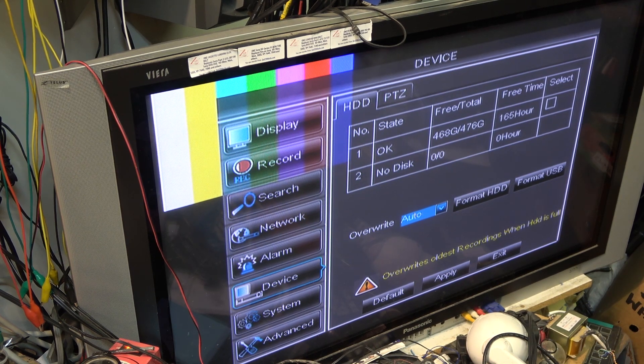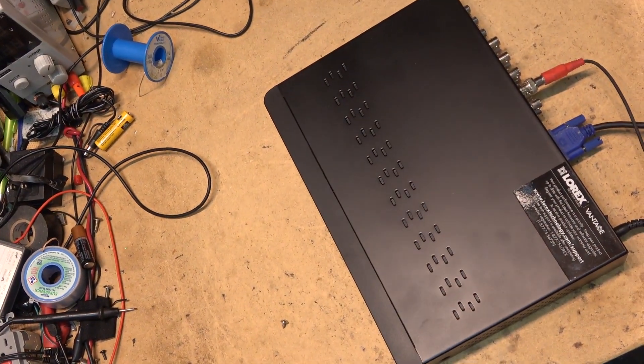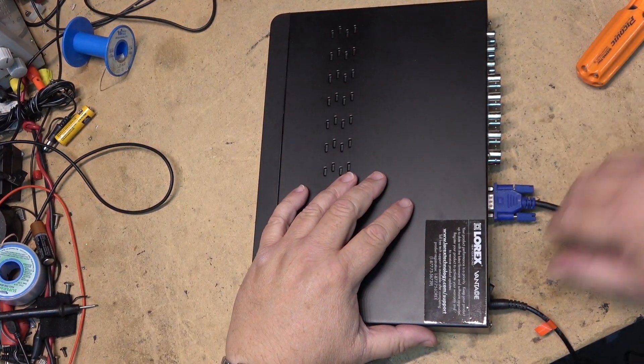Now it's going to tell me it's working — it said no good before. The hard drive was actually not spinning; now it just spun up. I've been giving this thing a tap, but at the customer's premise it was not spinning up, trust me. It said 'hard drive: none, no disk.' The hard drive on this one is toast. The client obviously wants to be able to rely on it — it actually failed and they had a break-in to the car and went to try to retrieve the footage, and it said no hard drive.